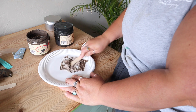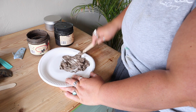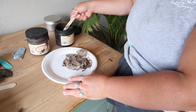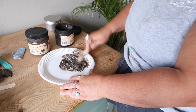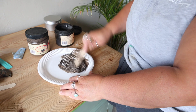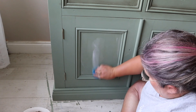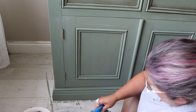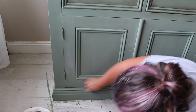I'm using a paper plate and put some clear wax on it with a little wooden spatula, then I used two chalk mineral paint colors — a little bit of Chocolate and a little bit of Coffee Bean — just to give me the right kind of brown I was looking for. This wasn't to match Best Dang Wax in Brown identically; I just wanted a brown wax for shading. I could have used black wax but I didn't want that much contrast — brown is a lot softer than black and I just wanted some subtle shading. You can actually make any color you like — yellow wax, blue wax, green wax — as long as you don't put too much paint in the wax, because it'll just make it more like a paint consistency.